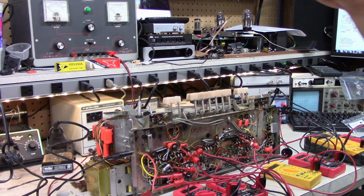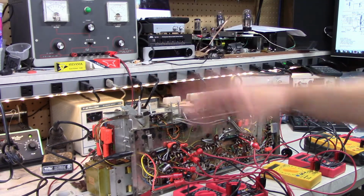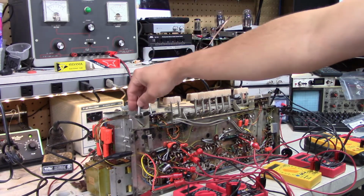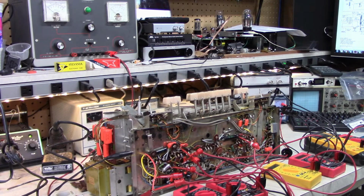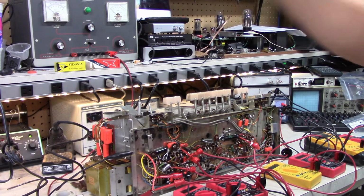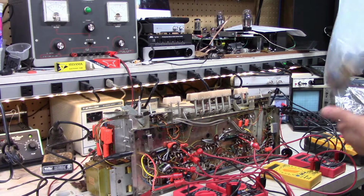and also I was debating if I wanted to change out the caps on the volume knob here. The way they do these point-to-points, they put components anywhere they can, and there were 6 capacitors around this thing and a bunch of leads coming off of it, and I was kind of thinking maybe I'll just leave those on there. And in retrospect, I probably should have, but unfortunately I didn't, and in the process I found that I'd forgotten 2 of those as well, and then in the process of desoldering the old ones, I overheated one of the caps that I was not going to change.